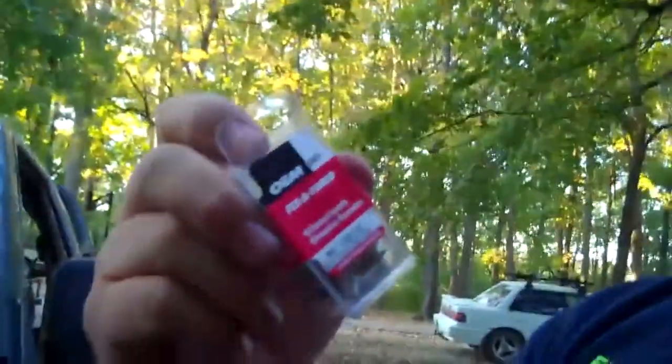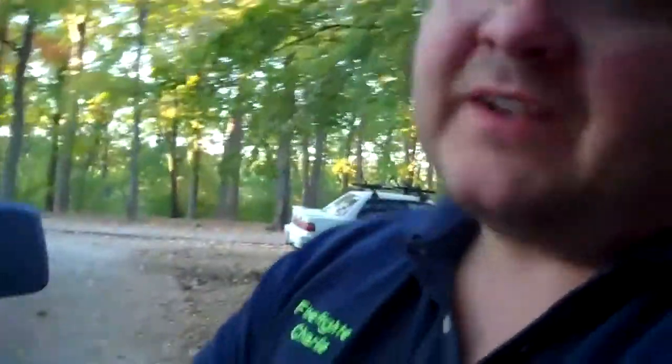Alright guys, got another quick repair video for you. If you ever had something break — a bolt breaks off in the hole, it's all boogered up, and just drilling it out is not going to do it — they make these things called helicoils. This brand calls it an OEM Fix-a-Thread. Basically, you drill out the hole to a certain size, they give you a tap, you tap it out, then you take a tool, put the helicoil on the end, and thread it down into the hole. The helicoil threads into the cuts and has threads on the inside that replace the old threads — brand new hole. All you need is your Fix-a-Thread or helicoil kit, the proper size drill bit, and a drill.